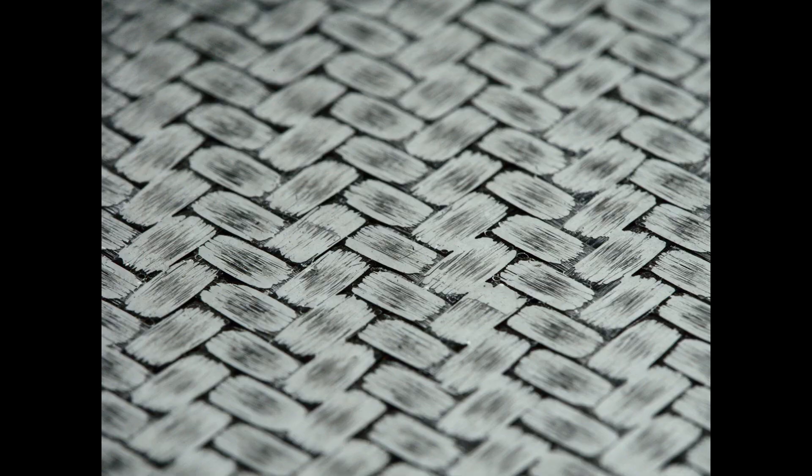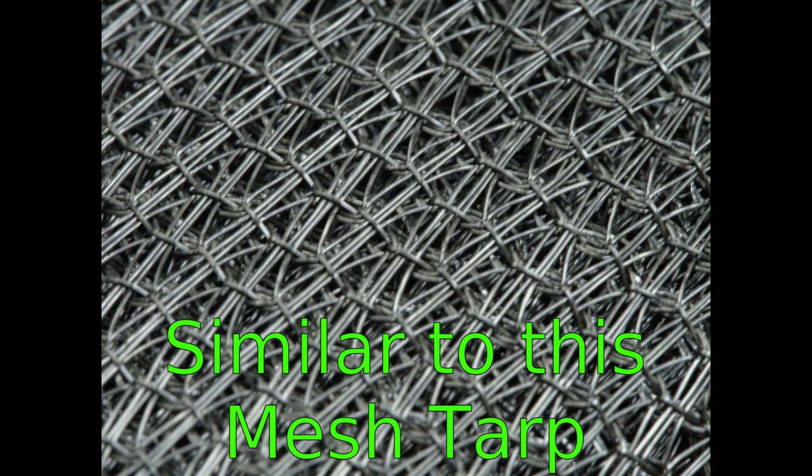If you've been following the videos on this channel, you'll know that I had a little trouble with my early resin infusions. I just could not get the weave filled on the mold side of my samples. I played around and I finally found something that worked, which was to use two layers of insect screen as my flow media. One of the things I learned from the Russ Imanis workshop at Oshkosh was that Home Depot or Lowe's shade cloth makes an interesting flow media. So I'll be doing a video testing that out to see how it works.